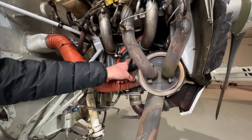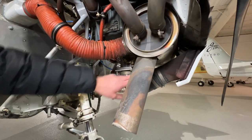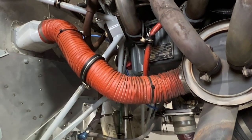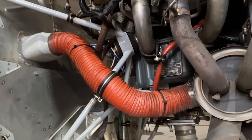This is the oil pan right here where all the excess oil is kept. The fuel servo is connected to the induction system of the aircraft. You'll see this large orange hose right here — this is called a scat tube — running to a shroud around the muffler. This is what gives you the heat for your cockpit.